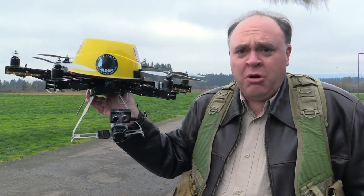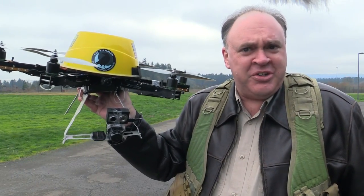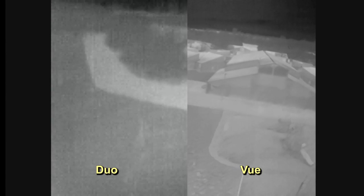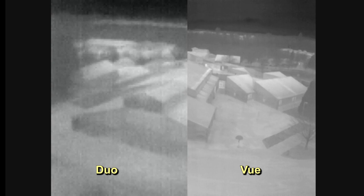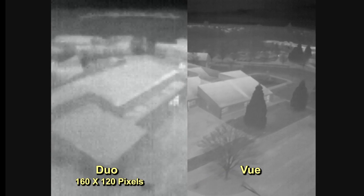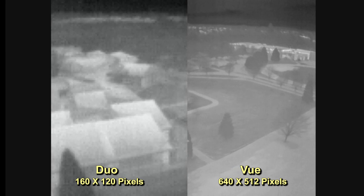Now, what I want to know is how does the Duo work compared to other thermal imaging cameras? So I've rigged it up here on Raven, alongside a FLIR VU Pro 640. Looking at the two side-by-side, the difference is immediately apparent. It's important to recognize that the Duo is not a replacement for the VU. The Lepton inside the Duo is a low-resolution sensor, at just 160x120 pixels, compared to 640x512 on the VU. Consequently, the Duo is never going to be great at identifying individual point sources, like a missing person during a search and rescue mission. However, when used at low altitude, close to the subject, it can provide some valuable information.